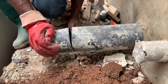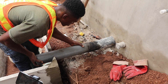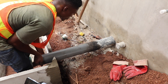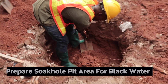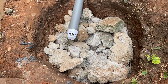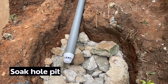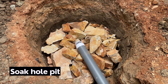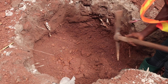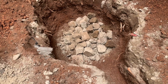The next stage is to prepare a soak-hole pit and then the drain area. The soak-hole pit is basically like a soakaway — it has to be filled with stones for easy penetration of the wastewater. In preparation for the soak-hole pit, you need to consider the uses and probably the lifestyle of the people who are going to use the facility. If heavy use is expected, then a big soak-hole pit must suffice. For a standard typical biodigester, a three-foot circular or diameter soak-hole pit should be okay.